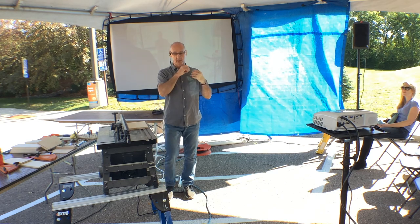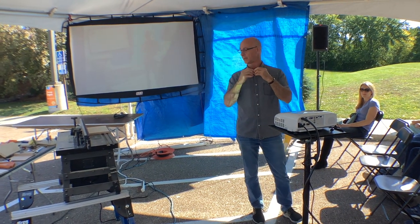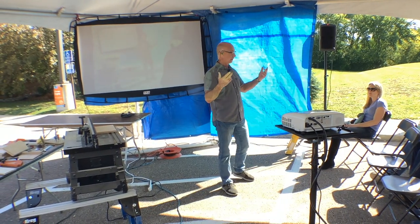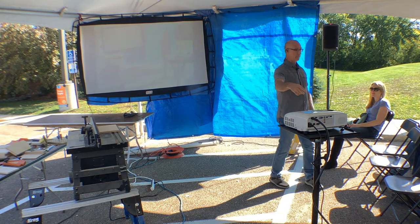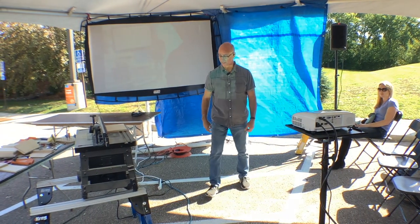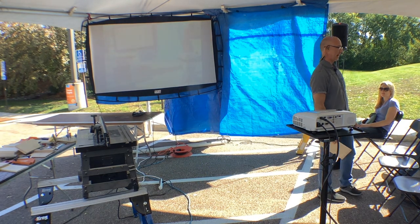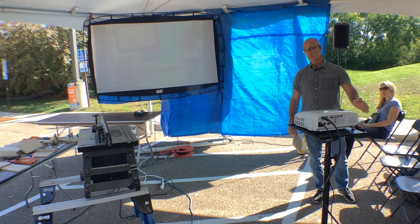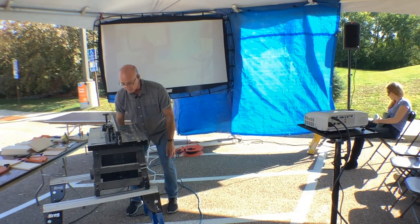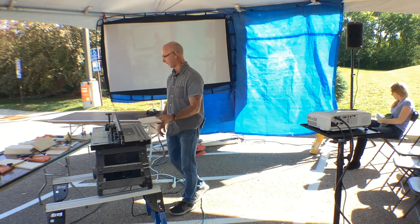down. I always blow it off. As just a habit with my tools, I never wipe my tools down. And the reason for that is just, it's a bad habit to get into when cutters are spinning in the world. It doesn't matter, bandsaw blade, bandsaws take forever to wind down. Table saws take a long time to slow down. Router tables take a long time to slow down. So I don't want to be in the habit of doing this, and then someday when I'm in a big hurry, because I'm behind, and when am I not behind, I'm doing that and the router bit is still spinning and I get up close and personal with the bit. So I'm very much in the habit of just blowing it off, or cleaning it off with a vacuum. And I never wipe tools down with my hand.